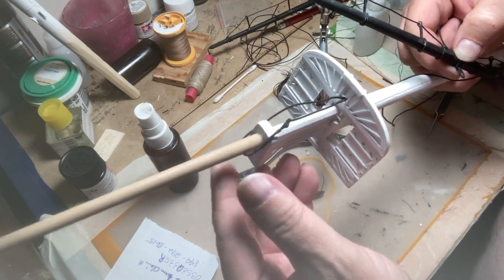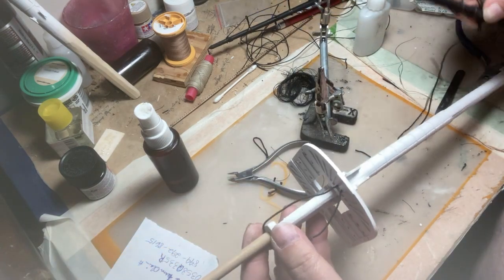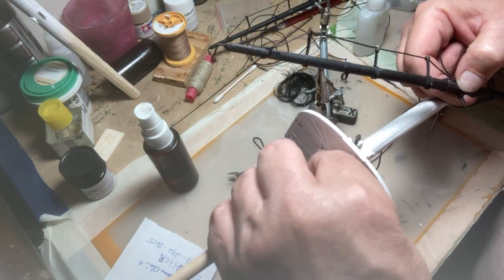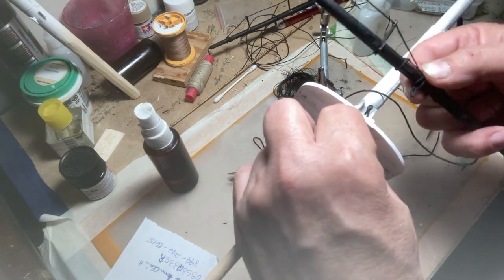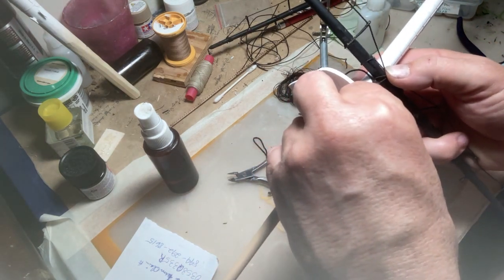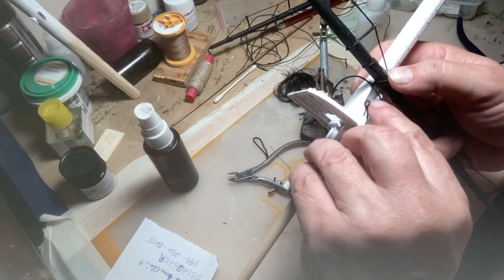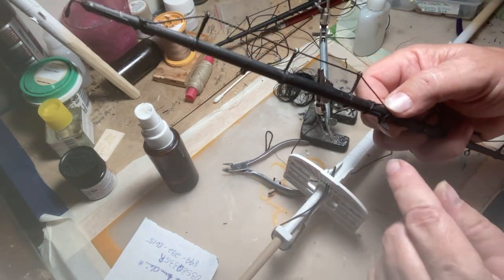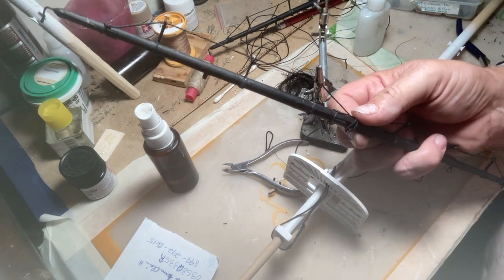You take your sling here. You have that on there. And where it comes down, there, right? Going to put your yard on or about where it's going to be. Right? So that's about where it's going to sit on the mast. And that distance, so that looks pretty close. 3/8 of an inch or so right there. I'm going to come back after I have the bullseye in here and show how I measure it to where I make the splice on here.